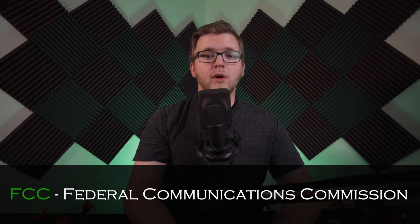It is important to mention that there are some FCC regulations that affect the use of FPV video equipment. These rules are put into place by the FCC, or Federal Communications Commission. There are a few channels that are not allowed to be broadcast on; however, these are usually limited by your VTX and you won't be allowed to select them. Output power is also limited to less than 1000mW or 1W. If a pilot wished to operate outside of these regulations, they would need to obtain a license.